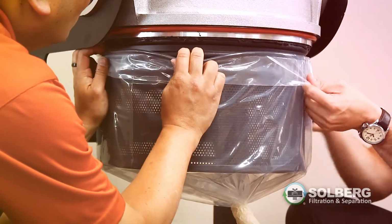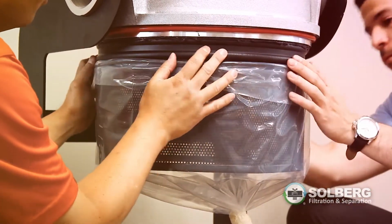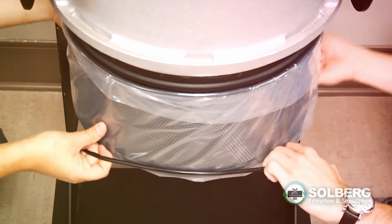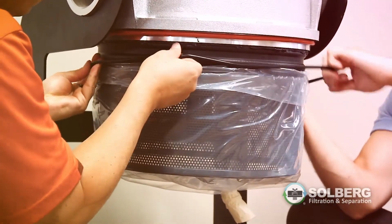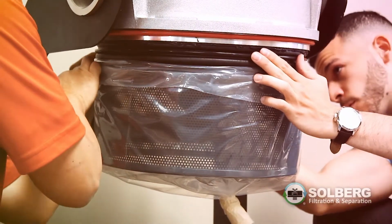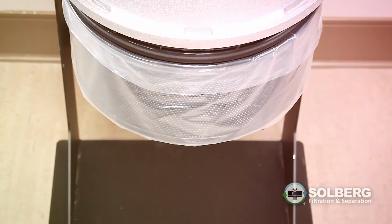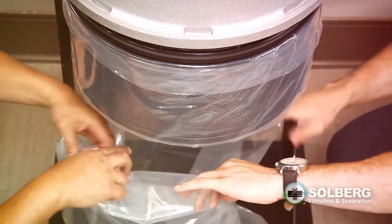Gently, while exercising extreme care, move the bag O-ring away from the enclosure so that the elastic O-ring is repositioned at the lowest groove. Install a new O-ring into the top groove. The replacement bag should contain the new filter element with gasket and knob with the washer inside. Place the filter element, washer, and knob into the bag with the element's open end facing upwards for ease of insertion into the filter housing.